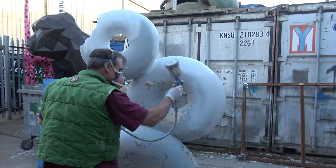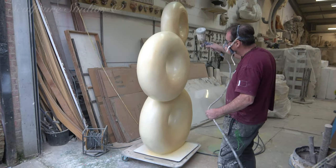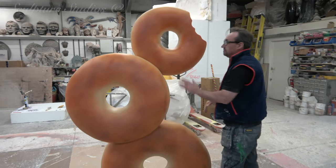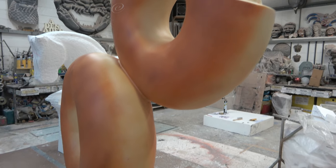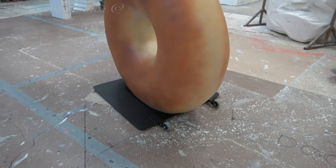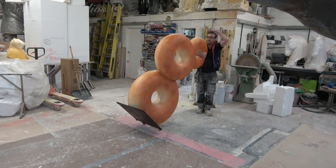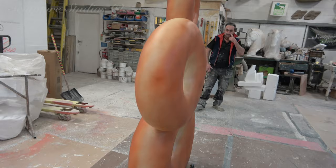Now ready for the artwork, we're going on with a final 2k primer base, whereby layers of light and dark browns are then added over the top to give it a look of lovely boiled and baked golden goodness. And here we have the finished bagels for the Bagel Marketplace — let's just have a look at the top of that. With the artwork now complete, this has all been sealed with a 2k lacquer to protect it from the elements of going outside. To make this sculpture a little easier to manoeuvre, we've added some wheels, which we've welded onto the plate. We did a little hunting around online and actually ordered rear stabilisers for a mobility scooter — these little casters on extended arms were perfect to install onto the base plate, to allow this to be easily tipped and scooted around, as well as small enough to keep the wheels off the floor when it's sitting flat.